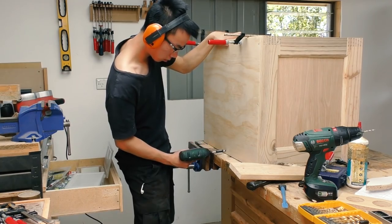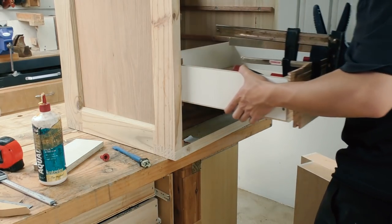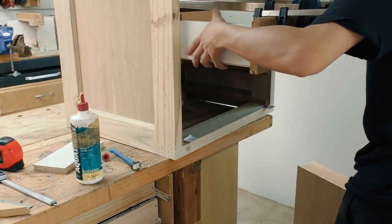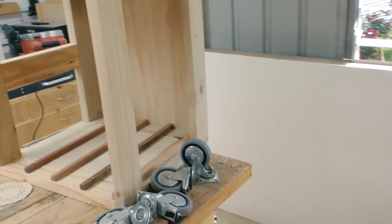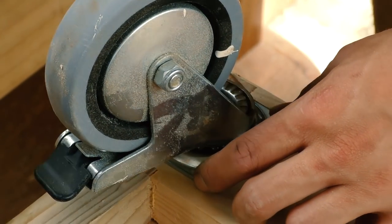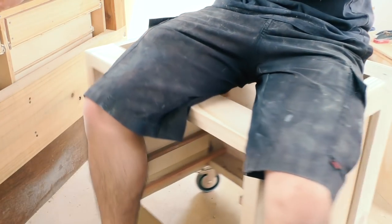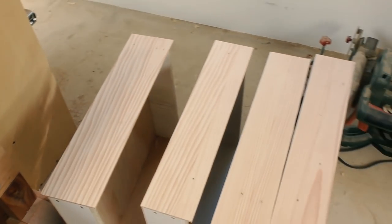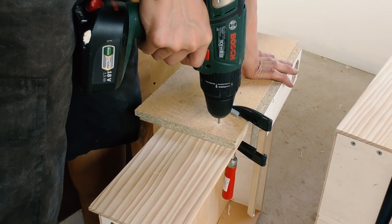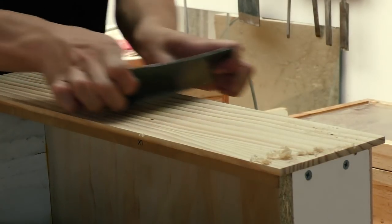The back is also just screwed on. Now I can get back to the drawer fronts and trim them to size. I've got the panel router on the stand and it's looking pretty good. But before I get too excited and put the drawers in — which will be hard to get out again — I'm going to put some handles on them. For that purpose I made a very simple jig to locate the holes for the handle. It's basically an L-shape with two holes corresponding to the holes on the handle and a centre mark between them. You line up the mark on the jig with the centre mark of the drawer and drill the holes. Before putting the handles on, I scraped the surface nice and clean.